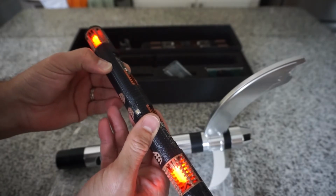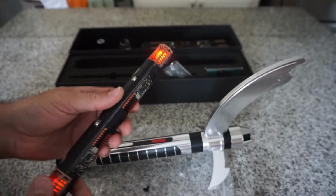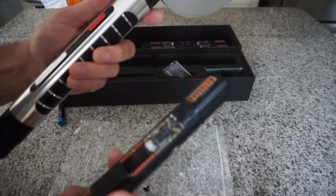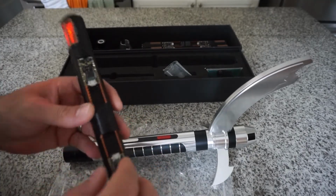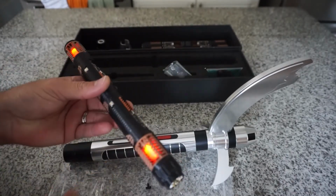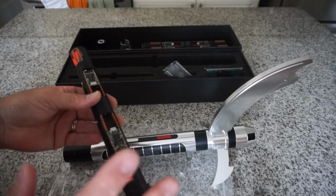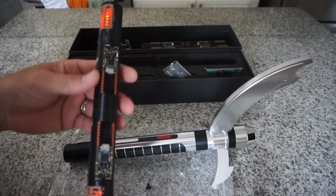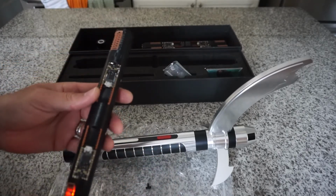3.40 volts. 3.41 volts. Okay. I've fully charged a couple of them, and some I've already drained their battery in testing. So this is one that's drained already, obviously. 3.4, still good to go. In the later versions of Proffie, there's the low battery monitor and the auto shut off. So at 3.4 volts, things will function. If I were to put this in with two full blades, maybe you'll get some sound distortion as that voltage decreases, but it should work even down to 3.2. Once it hits 3 volts, you'll start getting that low battery warning. It'll shut itself off to protect the battery.